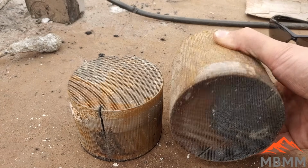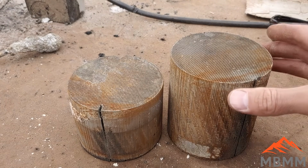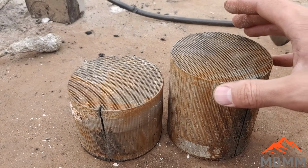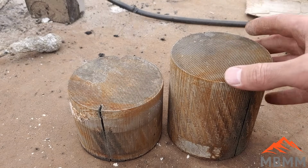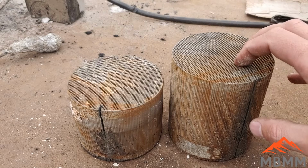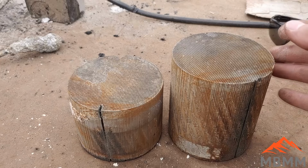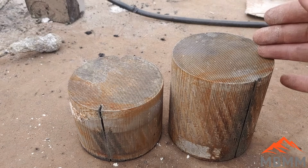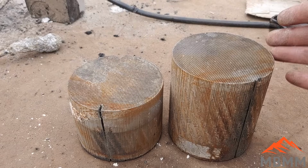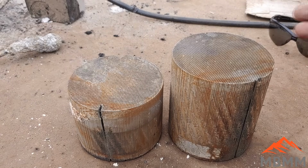Kind of the holy grail of this would be to not use any collector metal and just crush it down, mix it with some flux in a crucible, pour it, and get a little platinum or palladium bead. So that's the test we'll try first, see how that goes. But then I also want to test recovery, and so I'm going to do another test after that with a lead collector metal, and probably a third test with a copper collector metal, and then we can compare all three results.